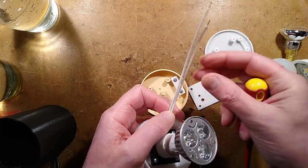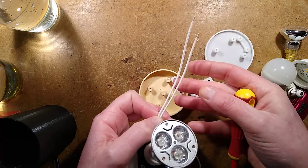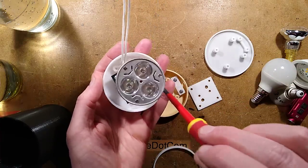It may take a bit of extra flux because this heat resistant cable tends to be sort of steel based, and it just makes it a bit more tricky to solder, but you can solder it. And then I put heat shrink sleeve over it. The other thing you can do, there's loads of room in here. You can put a little connector in here.